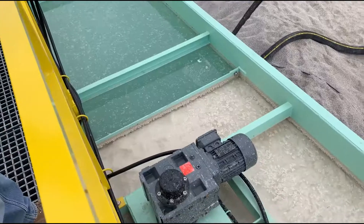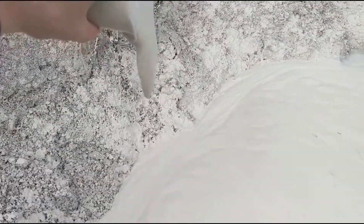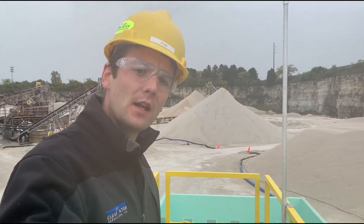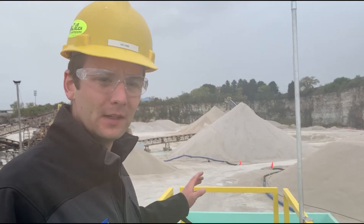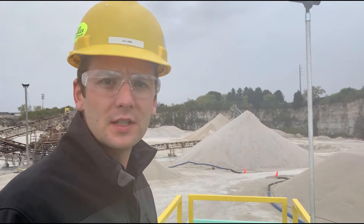We've already added the coagulant and we're beginning to mix the polymer flocculant. That's creating the separation process that we need to create thick mud and clean water. The flow is making its way through the clarifier tank — we're dropping out solids and we're left with the clean water on top. The clean water overflows the finger weirs and then it's ready for reuse in the process.